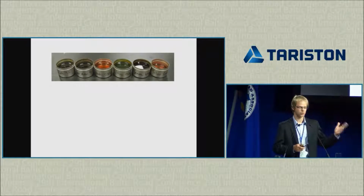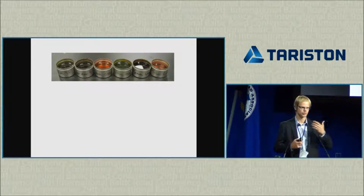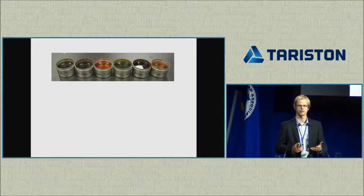So a rejuvenator is a sort of oil. It's not really rejuvenating the binder chemically. Otherwise, we would be using it on our faces and be forever young. But it does provide us the mechanical performance of the bitumen that we want for another service period of the pavement. So we want some softening effect. We want to regain the elasticity of the binder and so on.